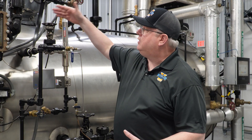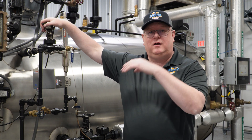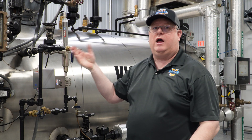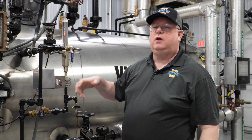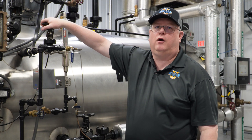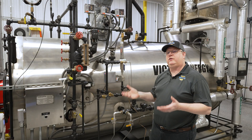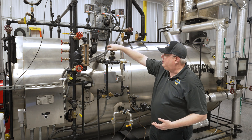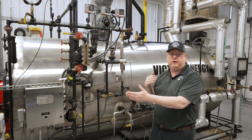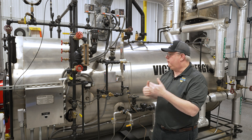However, these are metered valves, and it's not always easy to get it back where you want. Sometimes people will put a ball valve in series with this, so when they're not running the boiler, they close it. Otherwise, the reason this is graduated is so if we close it, we can open it back to the same position. Because with manual skimmer valves, if you get it right where you want it, you really don't want somebody going in there closing and opening it — it's going to be a lot more chasing your set point.